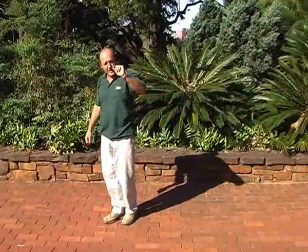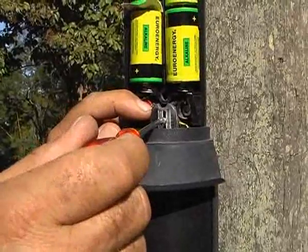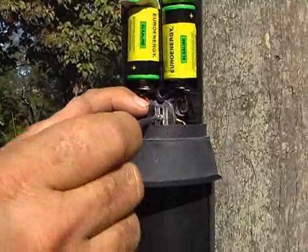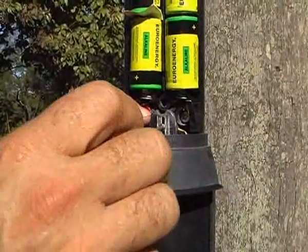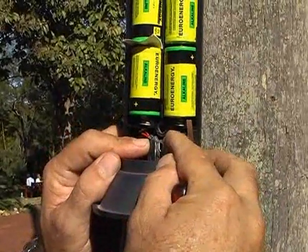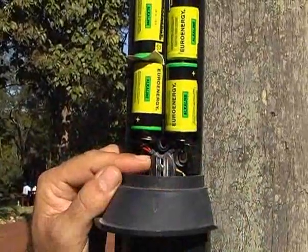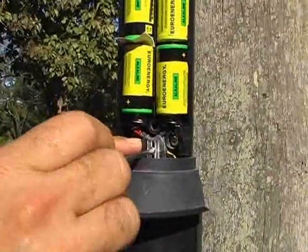One would have to adjust the top eye by lowering the beams a fraction. From our walk test, we were able to establish that the bottom sensor was going into the ground. To raise it, one would have to loosen up this locking screw by turning it anti-clockwise and lowering the entire sensor. Work in half a millimeter increments, as half a millimeter here would represent at least 3 meters at 20 meters. Lock it up and repeat the walk test.